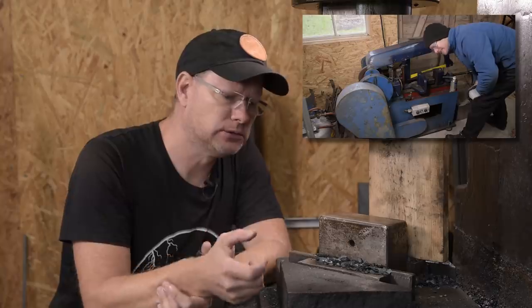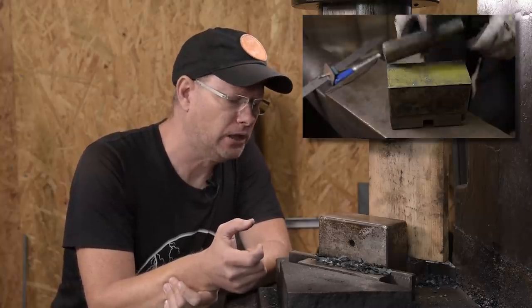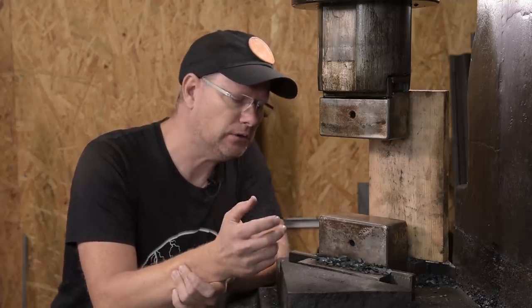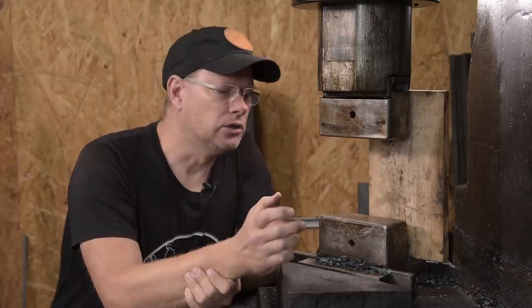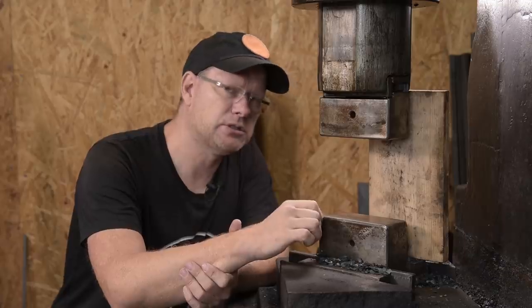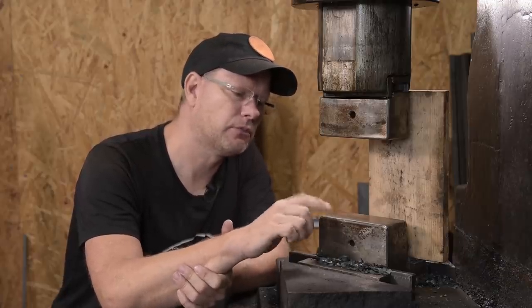To be honest, this is not a huge surprise. I used a saw to cut into hardened material. Shouldn't be possible. Although power hammer dies are not typically very hard, using a saw to cut something off should not be possible. Also, I believe this is 1045 steel. I came up with that after some research and spark testing.